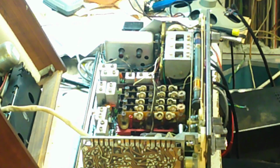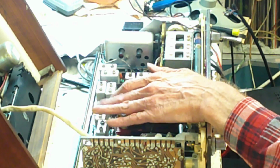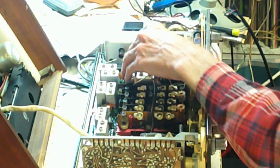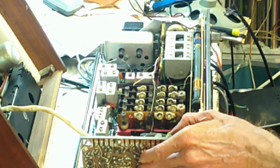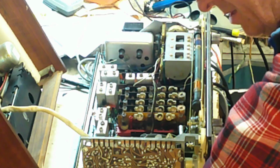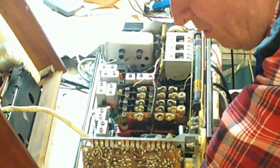Now this is what's called a stacked radio receiver, in that it actually has 10.7 as a guess and 455 or 456 around there on AM. Okay, so it's here, round here, and then it goes over here, which appears to be the output transformer side of it. It's transformerless, which is quite nice, but it does have a number of these Russian transistors which do tend to go open circuit or short circuit, so that is our first port of call.